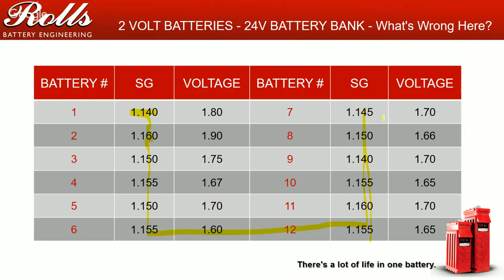This battery bank has been abused. It hasn't been taken care of. It hasn't been charged. Again, with this battery bank, 2, 4, 6 tenths of a volt higher absorption settings, longer absorption periods. I might even adjust my charge controller so they never go to float. You've got a lot of charging.